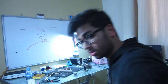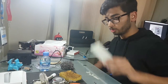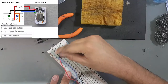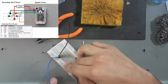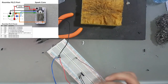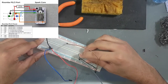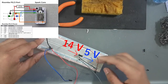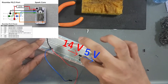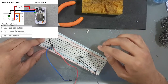Let's get the circuit up and running. Breadboard. We need four jumper cables. Some straight up wire. So ground, serial out in, and another serial here. And then we have this one, the weird DD pin that makes the Roomba wake up. Linear voltage regulator. All right, the rightmost pin is for output. And I have this little wire here that goes from the middle pin into the negative vertical strip of the breadboard, and that makes some stuff easier.